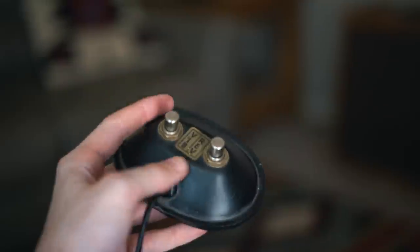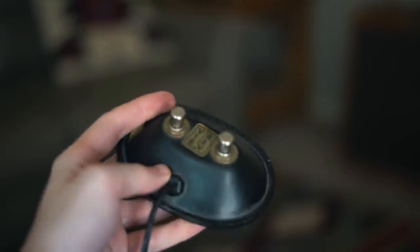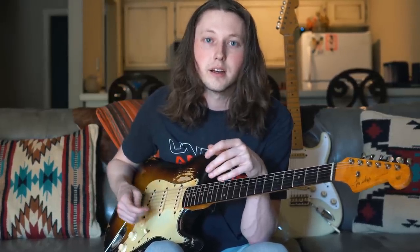If you guys follow me on Instagram, you would have seen over the weekend that the reverb was not working when I bought the amp. I ended up having to pull the reverb tank out, and I found that there was one wire that had come loose. I soldered that wire back in place and the reverb worked perfectly.